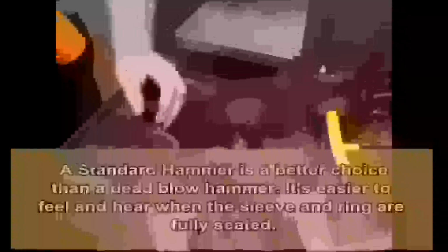We've got our drive-in tool. We've got an O-ring on the injector sleeve. We take the injector sleeve and stick it on top of the tool. Retaining ring going first? Nope. Good question. The reason is, once we get that down in there, we want to poke that retaining ring down and it'll expand. It just falls in. You want to see that again? No. And then we take our drive-in tool, stick that in. They're nice enough to get a dead blow hammer.